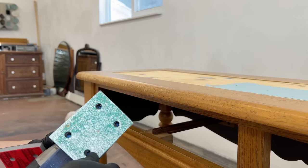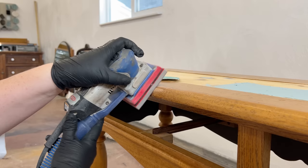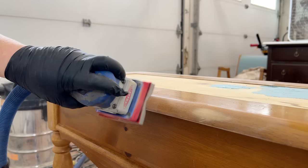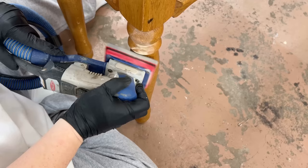While the filler was setting up I went on to sanding the rest of the table. I used a foam sanding pad on all the curved areas so I didn't grind anything flat with my sander, and worked out as many scratches and dents as I could. It's not really necessary to sand all the way through the old finish unless it's flaking off or the scratches go all the way down to the wood underneath, but a light scuff-sanding of the original finish will always help your paint stick a little bit better than not sanding at all.